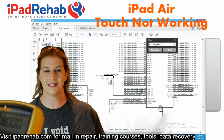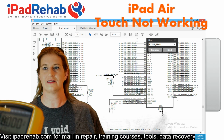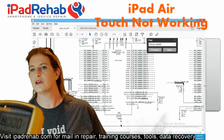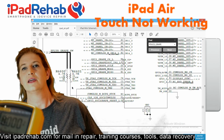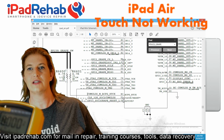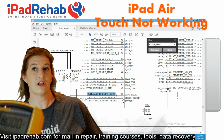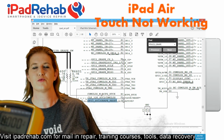But now that we can see that that line is the power line through which data is generated by these chips, especially over here. It's interesting that the master cumulus, but not the slave cumulus, only the master cumulus has off of this PP1V8 grape SW rail these two pull-up resistors and then these two data lines, cumulus M BCFG, which is probably real-time clock. And then this one, which is a reset line. Both of those sound really important.